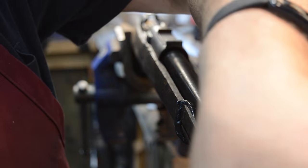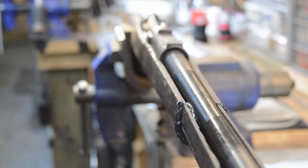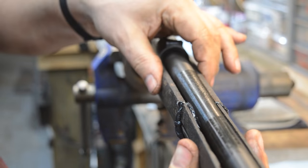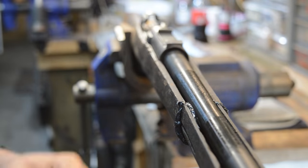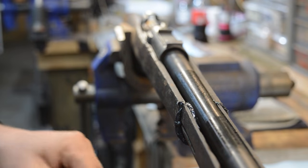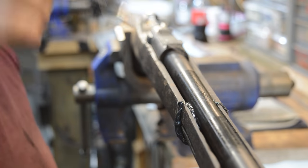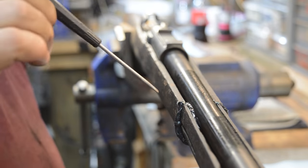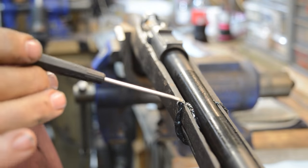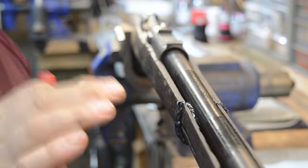Can't put the nose metal on. And with the nose metal on and the rear end of this receiver tacked down, this thing is in exactly the right spot and it can't go anywhere. And that is how it will sit until it hardens. Now, we've got a saddle here that we'll probably cut back out of this because we got a nice, clean, oil-free joint, and we'll come back in and file this saddle out later.